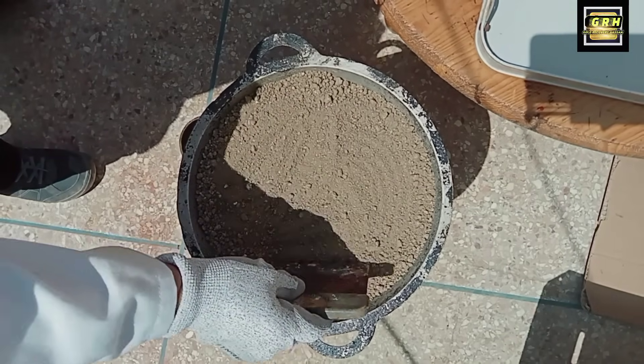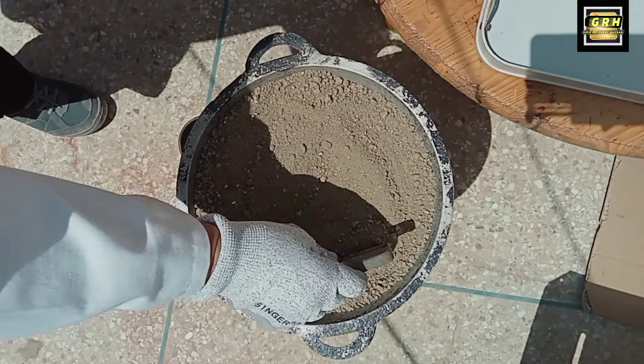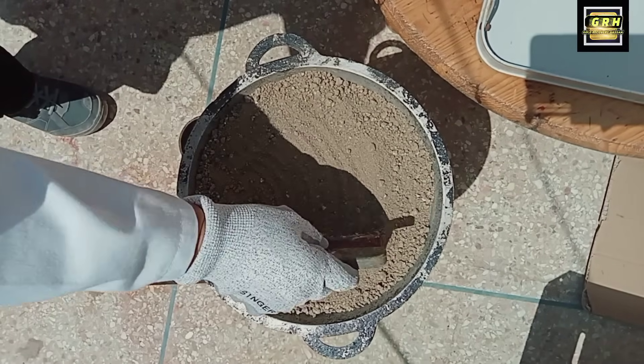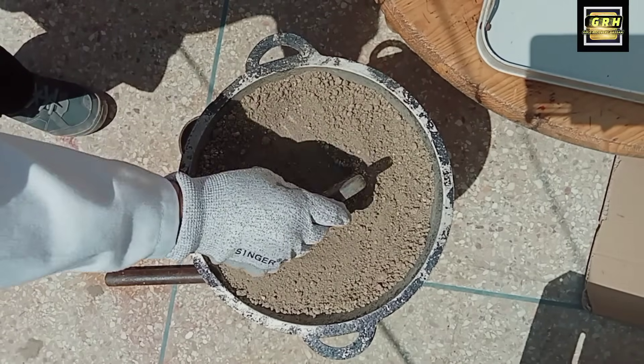This process is carried out in the presence or absence of air or other reagents. This allows almost complete removal of sulfur from the ore by the formation of oxides. Bring the dirt of the raw ore and heat it on the fire until you see it boil to get rid of sulfur, because sulfur spoils nitric acid and changes the properties of aqua regia.